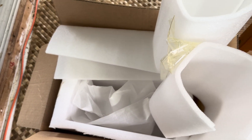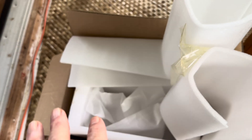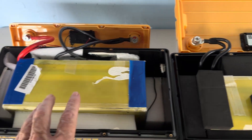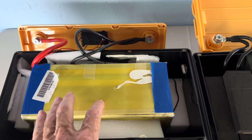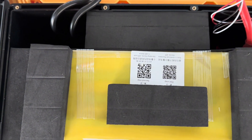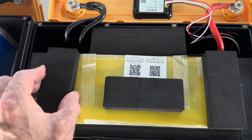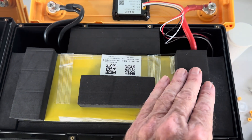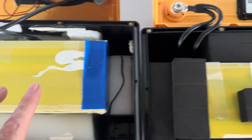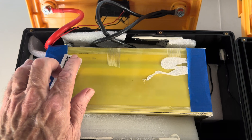I don't know what they were thinking with the first one — they were literally using low-density foam, just pieces cut off from the packing material. When this new unit arrived in the shipping box, everything was super tight. There was no way for that battery to be bouncing around in shipment. They both have the pouch cells. We did a capacity test on the first unit and it came in at 104 amp hours, so it exceeded its capacity rating. I'm not going to redo that test on this one.